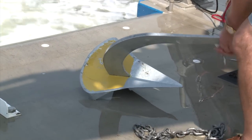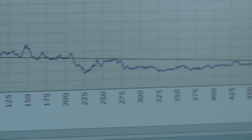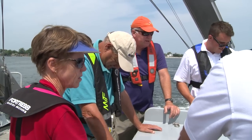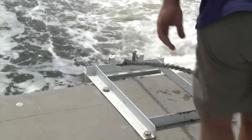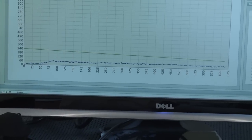The last test of the Spade was a little disappointing. We had an initial peak of around 300 pounds momentarily, quite a bit of time spent at 240 pounds, and then it just slowly tapered off to basically dragging. The anchor came up clean and we're not sure why it didn't set. We've asked ourselves how much the wire and chain drag on the bottom — we decided to test it. We paid out the same 20 feet of chain and 230 feet of cable and dragged it on the bottom for a full 10 minutes. It varied between about 20 pounds initially up to about 70 pounds, with the average around 55 or 60 pounds.